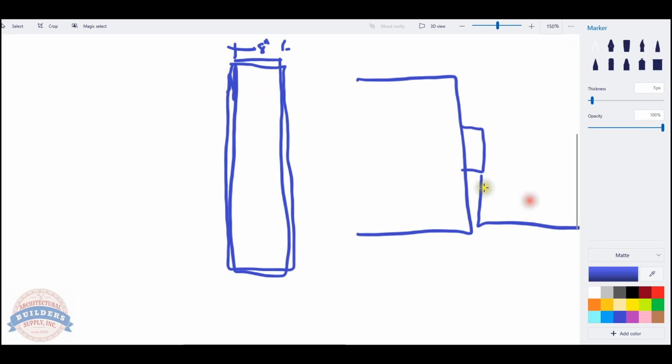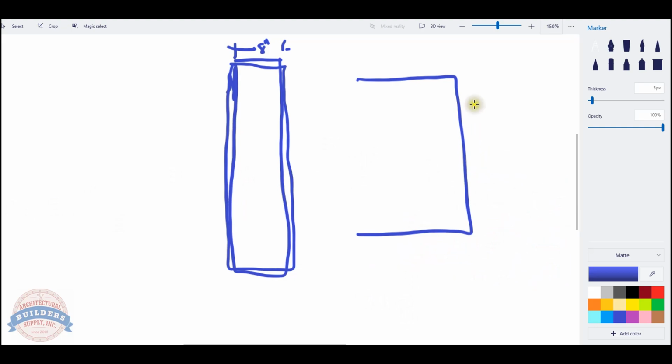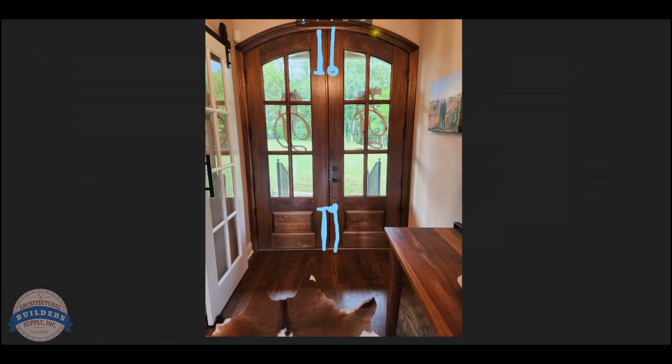Here is your door. Now, in an arch-top application, when that door goes to swing, depending on the effective inset dimension here, this is casing, from here to here, this part of the door can end up hitting on this part of the wall. Or, said another way, if this was an arch-top opening and this dimension was now 18 inch, and you were setting that door way down in the center, like this, where your inset is now 7.5 inch, this door is going to get only partially open before it's going to hit up here.